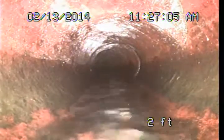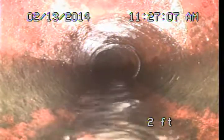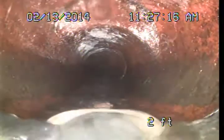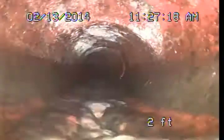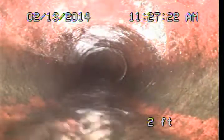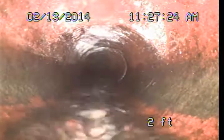Pulling back up to the structure now — the good news is that we do have just a single line. There's the original main clean out right there. For monitoring purposes this clean out will be sufficient, but I'm going to recommend the clean out down below so that that lower section can be cleaned and then examined.